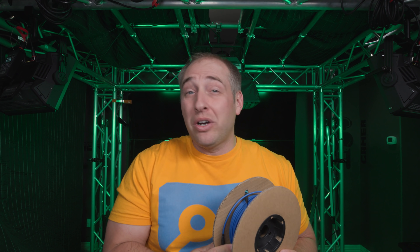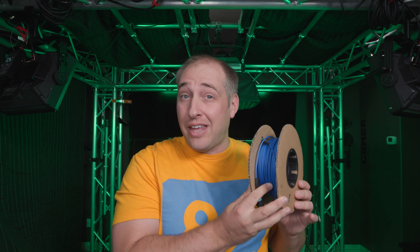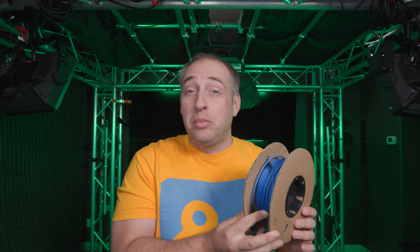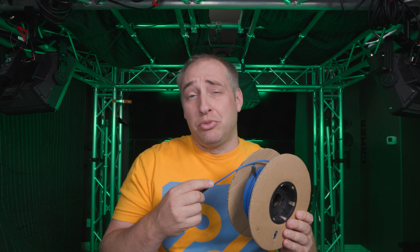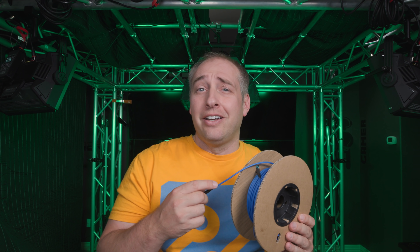So if you want to make life easy and you don't want junction boxes and all kinds of complications, you can just run plenum cable throughout an entire structure — and that's exactly what we're going to do. One other common marking you'll see is LSZH. This HP Enterprise cable is actually an LSZH-rated riser cable. LSZH stands for Low Smoke, Zero Halogen, meaning this cable is not only non-halogenated but also flame resistant.